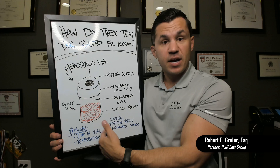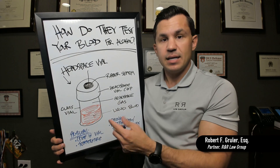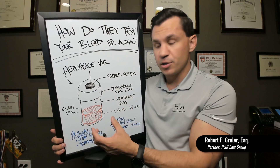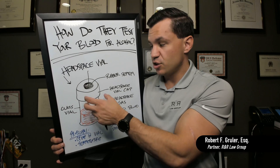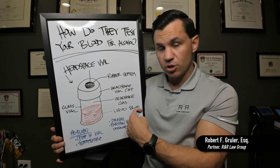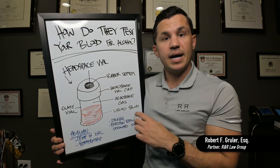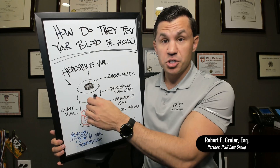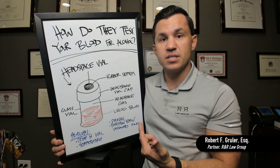Sometimes we'll see variability in temperature. This vial needs to be heated and slightly shaken in the auto sampler. You want to make sure the temperature is consistent, because if the temperature is too high, the pressure the machine is expecting will be too high within the container. Similarly, you want to look for problems with the syringe. If you see error logs where the syringe is puncturing, not puncturing, bending, or being replaced frequently, that may show you there are problems in the sampler.